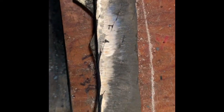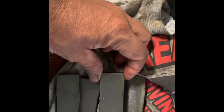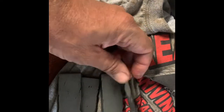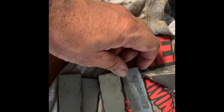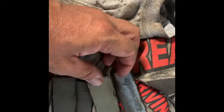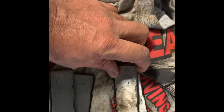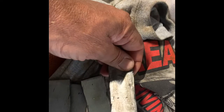I'm going to cut this into four sections and forge weld two of them together to make another billet — kind of a cable Damascus San Mai. Here are my four pieces. They didn't clean up as well as I'd hoped; I couldn't get rid of all of the little cold shuts or imperfections. I think where I messed up is after I welded the ends, I should have opened the cable up and shook a bunch of the crud out, and I forgot that step. I've done it both ways, but it seems better when I do it that way. Being a San Mai — maybe Go Mai — I don't think it'll be a big deal. I think I can get rid of a lot of that.